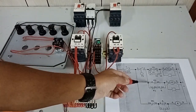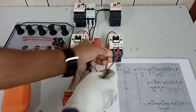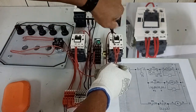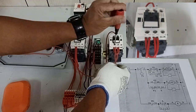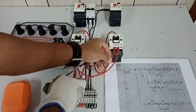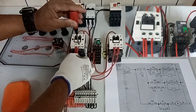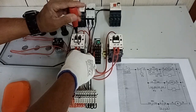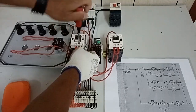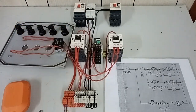From the normally open contact of M2, we go to the normally closed contact of M1. From the bridging, this wire goes to the normally closed contact of M1 — this is the interlocking for activating our M2. When M1 is activated, M2 cannot yet activate. I have also tightened this wire going to the normally closed contact of our M2.